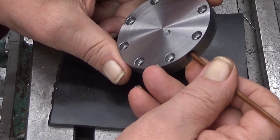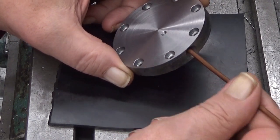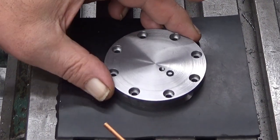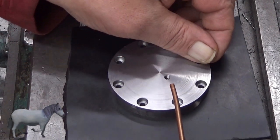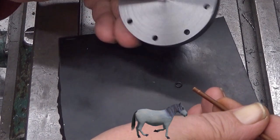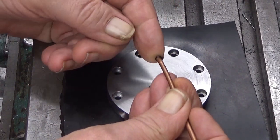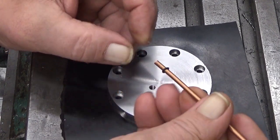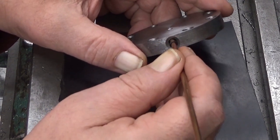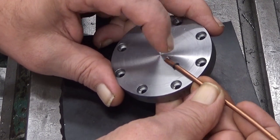So, we need to have this in this hole so that it's oil tight, and so that it stays there. Now it's not tight. Well, we can use this. That's an O-ring. Where did it go? Oh, there. It's so tiny. So I can have it here, like that. And now this would go there quite easily, actually. And then when the 3.3 millimeter hole starts, this won't go any further.